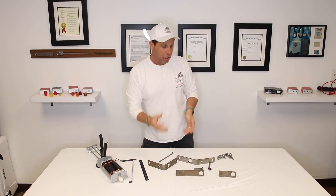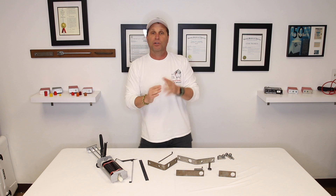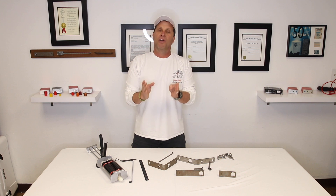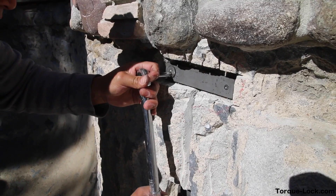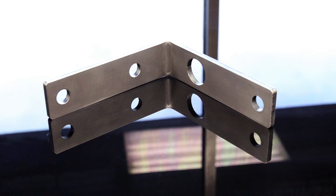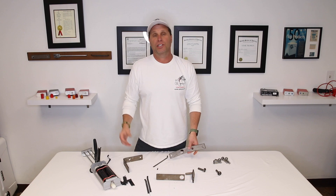What does work are post-tension staples — TorqueLock post-tension staples. They're the only controlled post-tension staple on the market. You literally set these into a wall, you countersink them so that they can be plastered over, tiled over, or whatever you're going to do. You can control the amount of compression between the two pins. By using a torque wrench and achieving a certain torque, you're actually pulling these pins together and creating a controlled compression, so you're going to get a lot less failure. Not only do we have repair products for flat surfaces, but we have them with 90-degree radiuses and 45-degree radiuses where we can put our cam in and control the compression between the two sides of the crack.